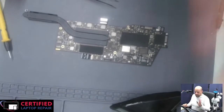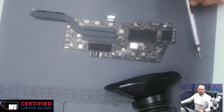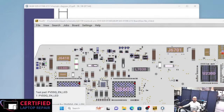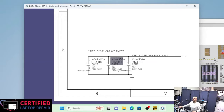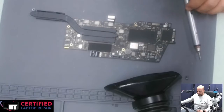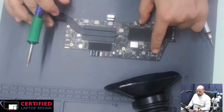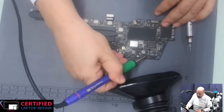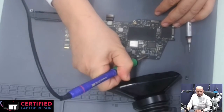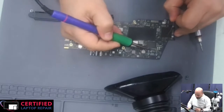I'm going to find a replacement capacitor from the donor board. As you can see on the schematic, this capacitor is 68 microfarad, 16 volt. I was able to get a replacement. I'm not going to use hot air because there are plastic connectors nearby that could most likely melt, and I don't want to deal with covering them.